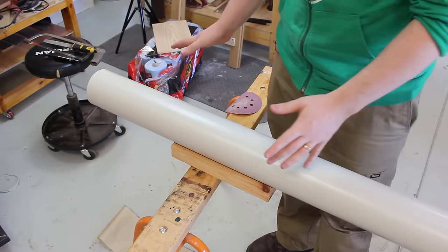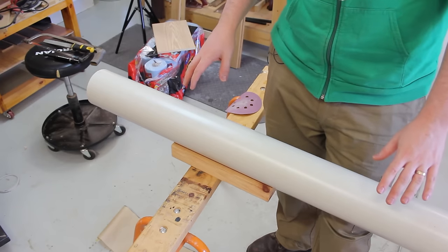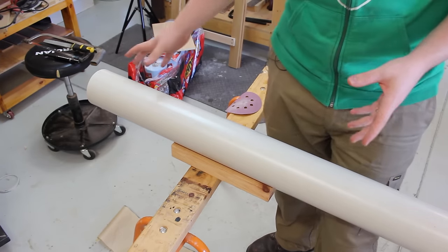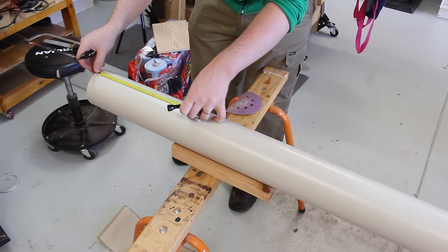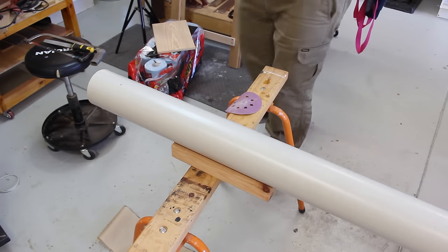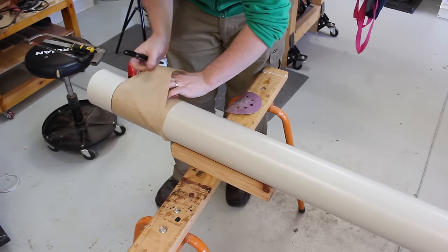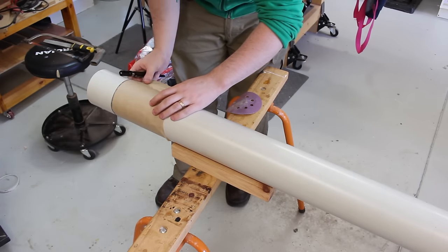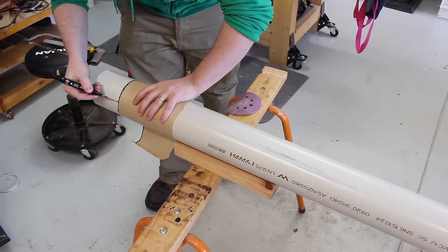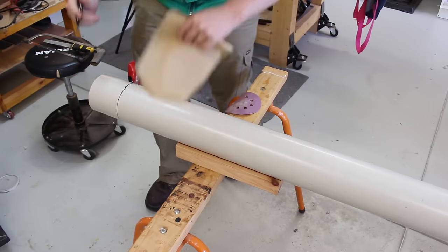For how I'm feeling, it's just easier to cut this with a hacksaw rather than the miter saw — it's not that big a deal. To start off with I need a few spacer pieces to go between my connections, so I want to cut off about 100mm. It doesn't need to be overly precise for the length. The next thing is how do you get a line all the way around to make a nice straight cut. Get a piece of paper, wrap it over itself, and in theory that should make a 90-degree line. This isn't going to be 100% straight, but it's straight enough for my purposes.